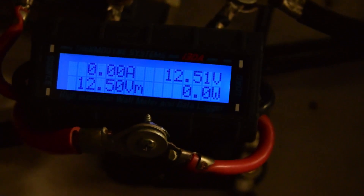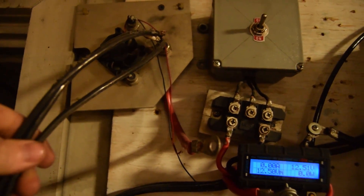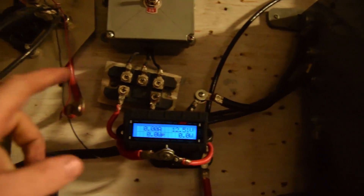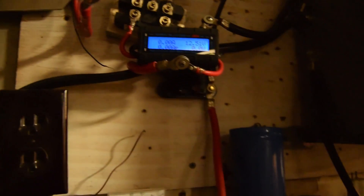It's off by about a tenth of a volt — probably five hundredths, actually, because it's almost in line with this one. Solar is disconnected. Here are the three wires coming in off the solar panels from the roof and the front of the garage — I'll have 500 watts in solar. Disconnected here, with the positive coming off the diode, so solar is out of play.